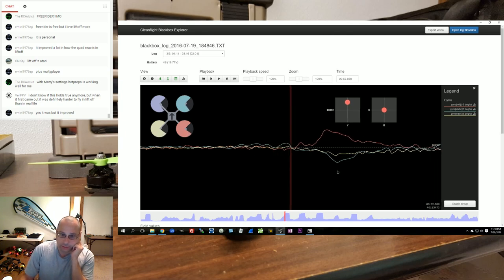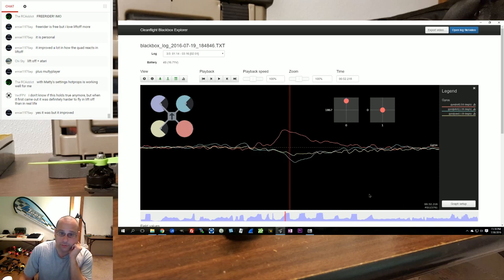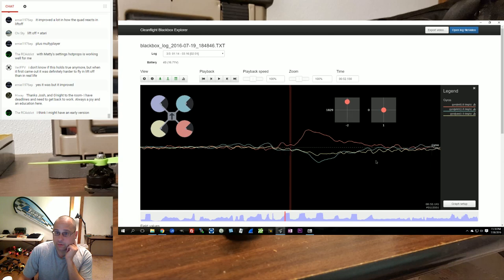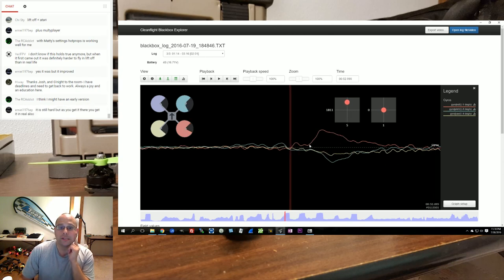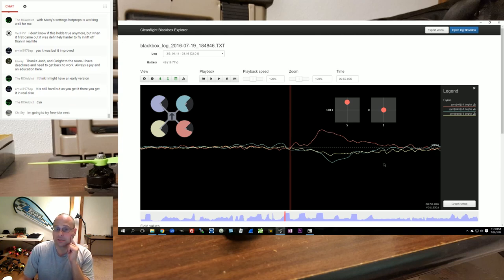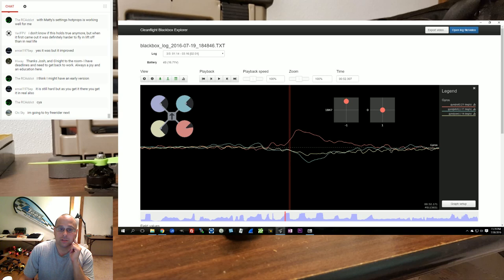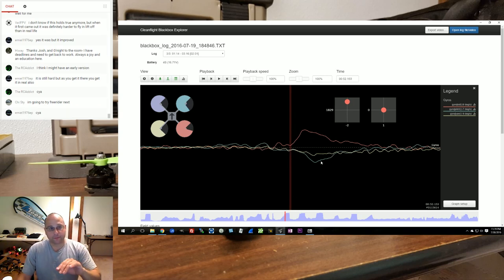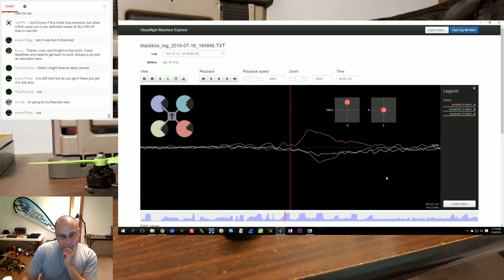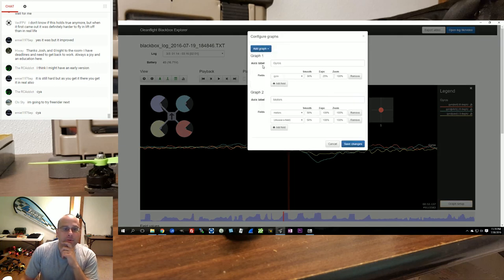So if we watch here, we can see the throttle is up. And as you raise the throttle, the back right motor goes to full. See that? And the roll gyro. So this is interesting. Notice that suddenly the roll gyro changes, even though the stick doesn't move. Watch the stick. Oh, did the stick move? No, I don't think a stick moved. So the roll gyro, the copter suddenly rolled right or left, I'm not sure which, even though the stick didn't move. Let's look at the motors.